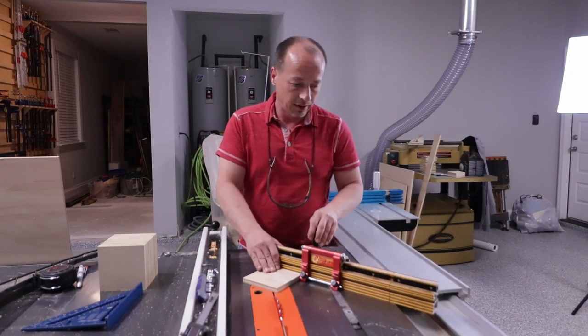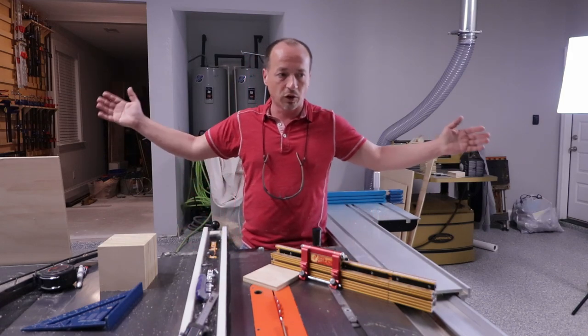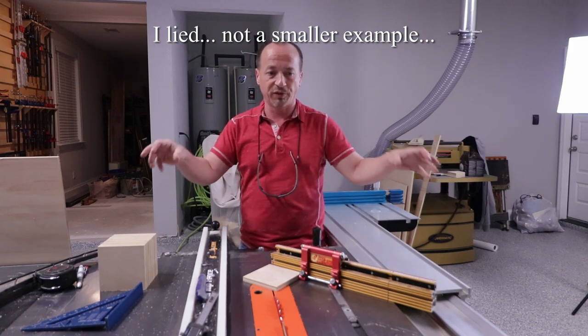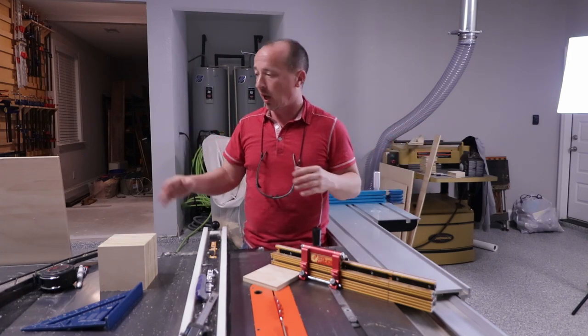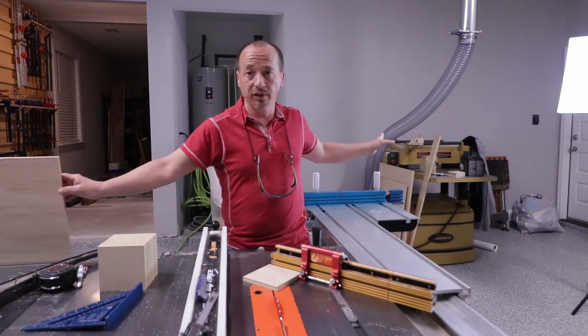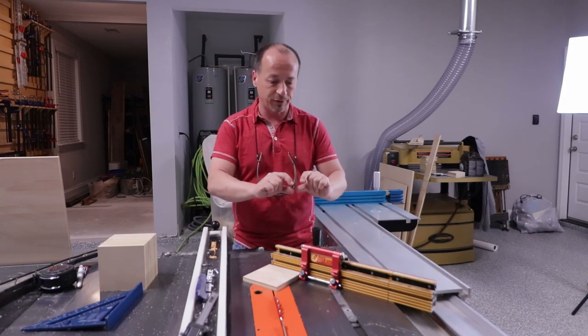The next rack that I'm making for the French cleat wall is going to be a large four foot wide, two row bin system, with different cubby holes for putting stuff. So the bottom row is going to be slightly deeper, top row slightly shallower. I've got the back that it's going to hang on cut out, and a bunch of the pieces for the actual bottoms of them, and a front lip.